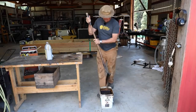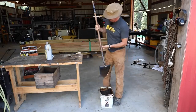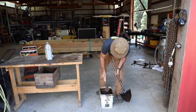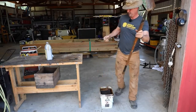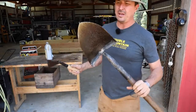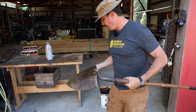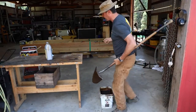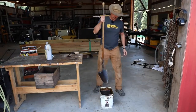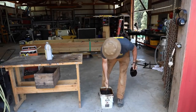What you do to make it real handy is keep it right where you're going to be hanging up all your tools. Then you just give the tool a plunge in the sand and work it out. Same with your little hand tools — just give them a plunge in there just one time. Knock off the excess sand a little bit. But look at that — you get a nice, thick, heavy coating of oil on them. It doesn't take time, you don't have to get a rag and get it all over your hands. You can just have it handy right there and as you go by, just give it a shove in there.